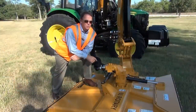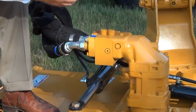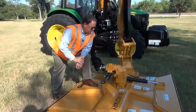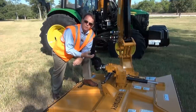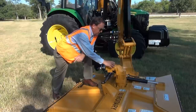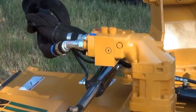Another feature on the Machete 2 hydraulic system is where the pressure relief valve is located. As you can see, it's actually directly attached to the head motor. Occasionally, an operator is going to come across something he can't cut — a stump or a concrete culvert is most common. That generates a tremendous shock load on the system because the blade bar suddenly stops. With the pressure relief valve located close to the motor, that hydraulic spike is relieved at this point and not transmitted back up the hydraulic system, as you will often see with some other mowers.